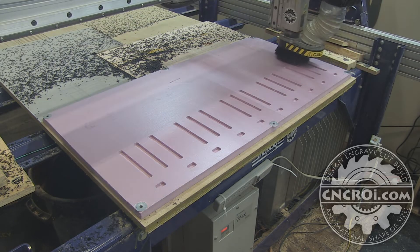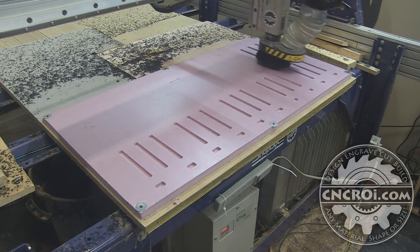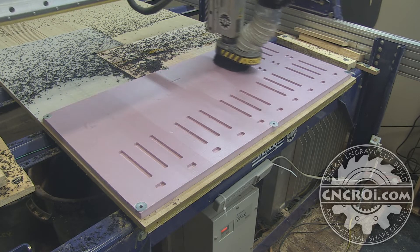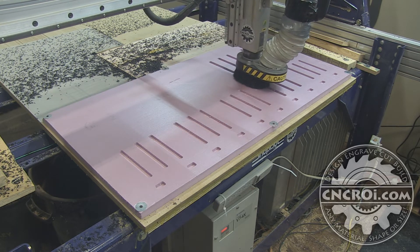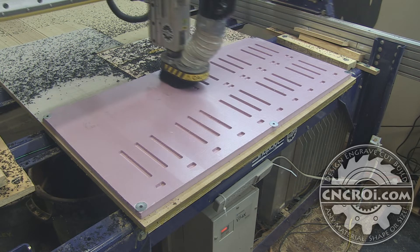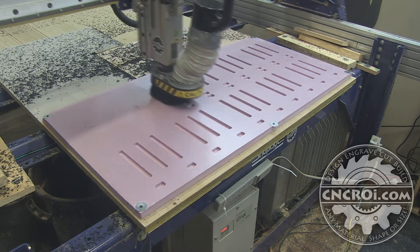There are multiple levels to what we're doing, so you want to make sure you're working your way down through the material. What that means is let's say you have a pocket that's half an inch, another one that's one inch, and another that's an inch and a half. You don't want to go to the inch and a half first and then do the half inch, because you'll have issues with the final product looking kind of rough. What you want to do is slowly work your way down: do the half inch first, then go over it with the one inch, then an inch and a half deep — then you get the optimal results.